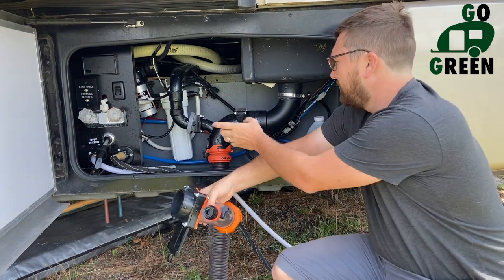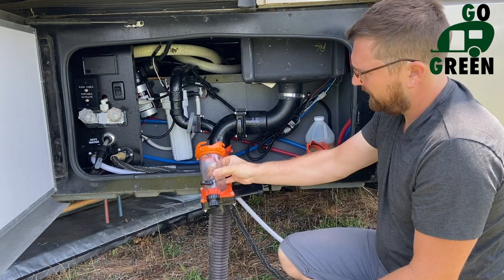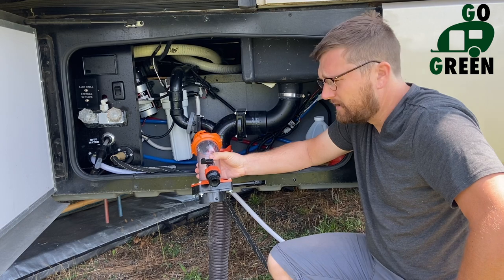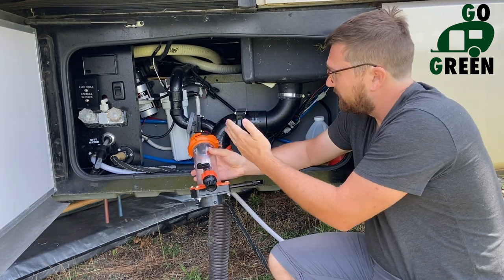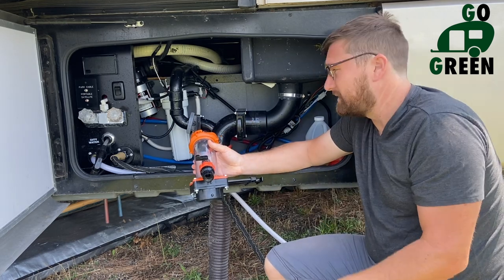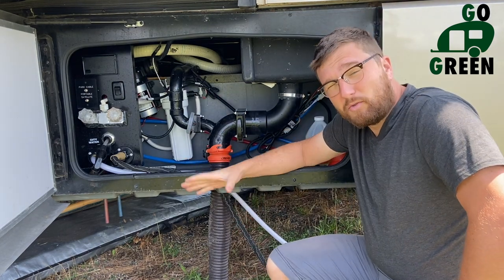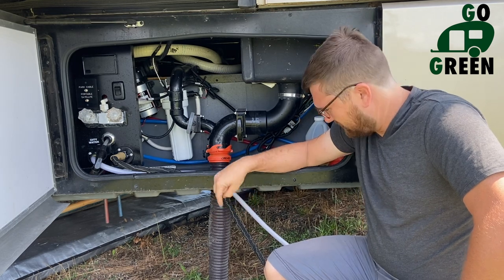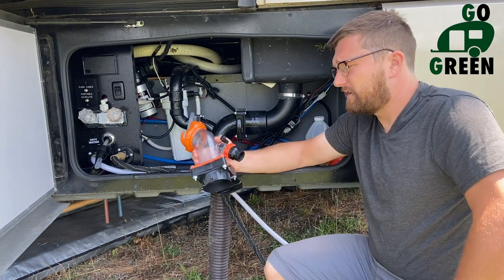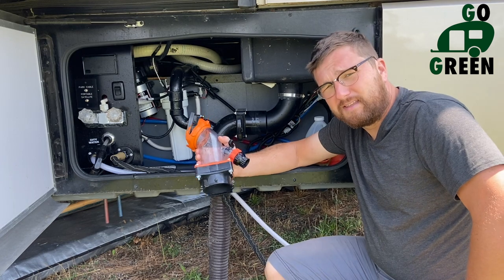Now, say I have a clog and I can't get anything to drain out of my black or my gray. We have this apparatus from CAMCO — I'll have a link in the description. You hook it up to your black tank and hook up your hose here. You close the valve behind it and flush water into the tank that is clogged, and you let it run until you hear something push through, or you'll see the pressure release, or something will change. Then you can dump it out and keep doing that process until it completely empties out the clog. A lot of people get their black tank clogged because they leave it open and the water runs out, but all the solids and paper get stuck inside either the hoses or inside the tank or at the valve. So instead of spending $300 to have a tech come out, you can buy this for about $50 on Amazon — I'll send the link — and it's a really quick way to get things loosened and moving again.